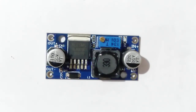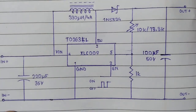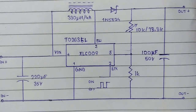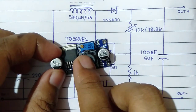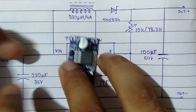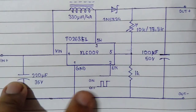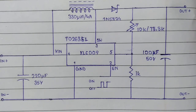This makes the circuit a very handy choice for smaller applications such as a mini boost converter. In the circuit schematic, this side is in-plus, this side is in-minus, here is out-plus, and here is out-minus. You'll notice we have a 35-volt capacitor and a 50-volt capacitor, the same capacitors used on the physical board, serving as input and output ripple filter capacitors for ripple filtering and PWM control.